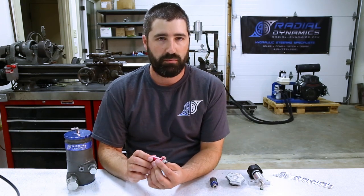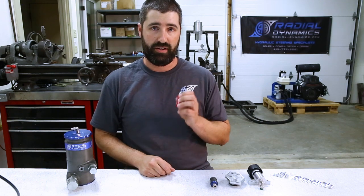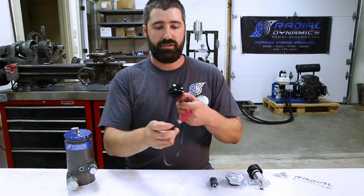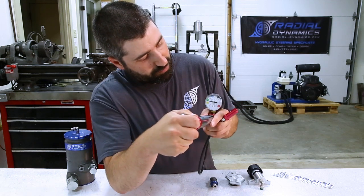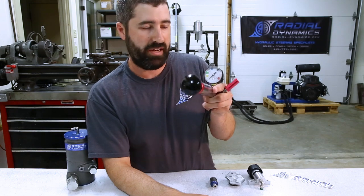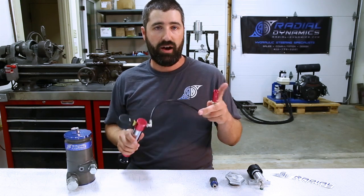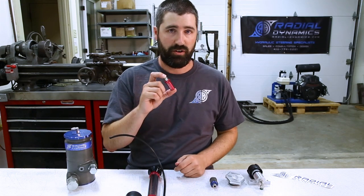Another type of valve I've seen people use is a brake residual valve — like this 10 psi valve I got off Summit Racing. This is designed to hold 10 psi in your brake calipers to keep a little bit of drag on the brakes for racing. But this valve was really designed to operate in a completely flooded liquid environment. If I go ahead and pressurize this, we get some resistance — about 10 psi maximum depending on how fast I pump — but it doesn't actually hold any air pressure. In a reservoir situation, we're designing the valve to hold air pressure at the top of the reservoir, not oil. So while this valve gives some resistance to flow, it's not going to give us very good holding pressure in a reservoir.